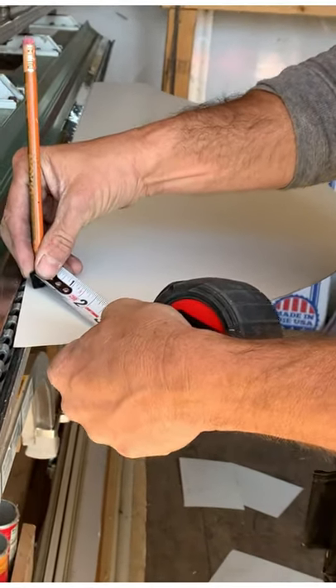Now I'm not sticking out as much. It's okay to stick out an eighth or so — it's better to stick out a little bit than to be too small, because if you're too small you can see this piece we're caulking. Glide your finger for a nice pretty bead on the outer edge, then the rest of it just put a lot of silicone — and I mean a lot. Don't be bashful, don't be cheap. Put a real thick bead on the inner edge and all through the middle. Then glide your finger on the outer edge where the fold is for a nice, pretty seal that doesn't ooze out.